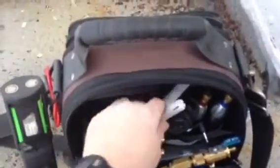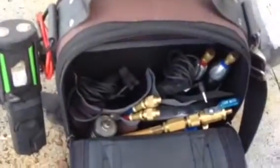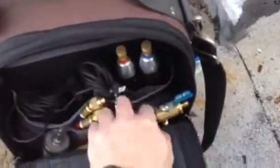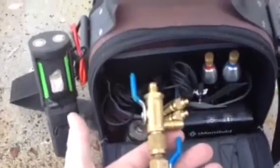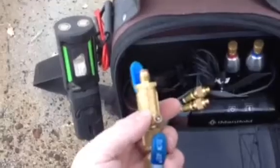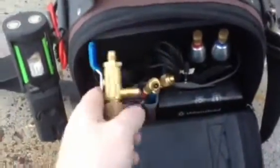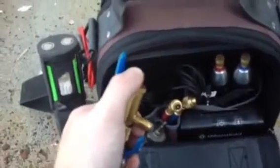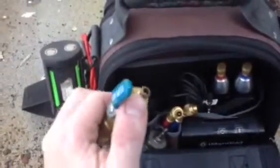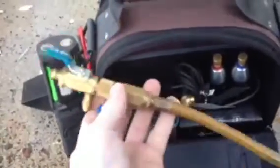Here is how I am storing my iConnect stuff. Here are my two temperature probes. I got my pressure probe in here, both of those. I also have my valve core remover that I am using for charging. I hook my probes with this little hose attachment to the side here. I put my jug with the hose to the back and I charge using the ball valve here. It works out perfectly — no need for a manifold.